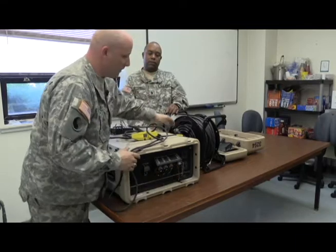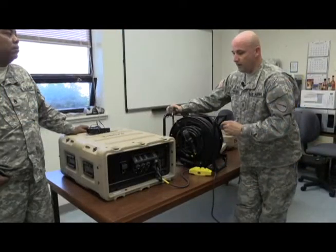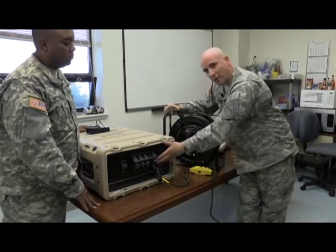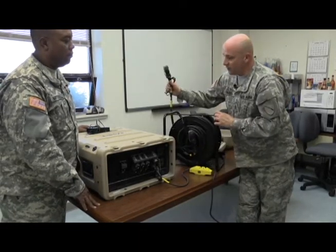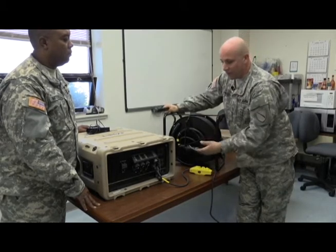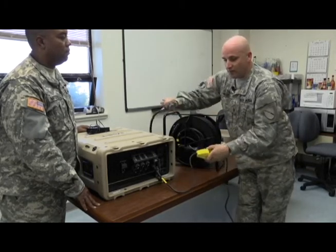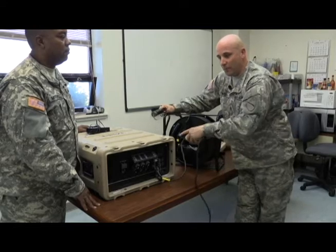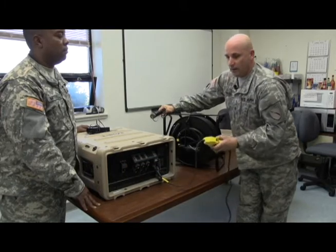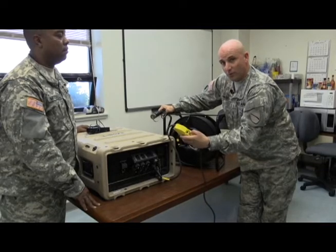The smaller one is the same thing — there are caps on it and little grooves inside that match perfectly. So we've hooked one of them up. What I want to explain is, for this cable that actually gets hooked up to the indoor unit itself, keep that there until you take this out and plug it up to the pedestal outside. If you didn't do that and you plugged it up, this cord would be wound up and could potentially break. Once both of these are hooked up, we turn this indoor unit on — here's the on button on the left-hand side — and there's a little clear button on this adapter that you have to push in order for it to come on.